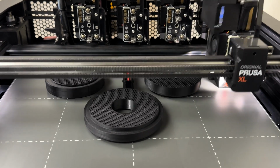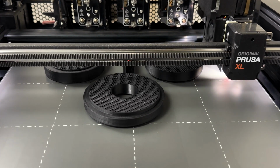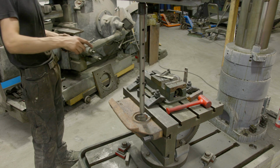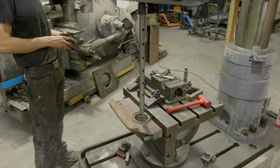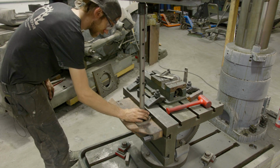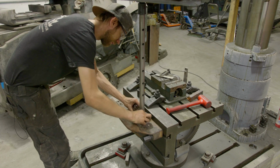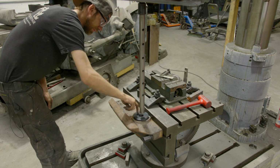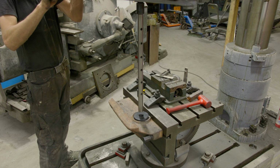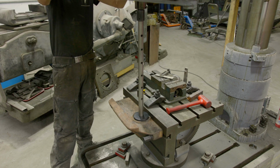I figured out that this bore was 3.5 inches plus a little bit because it's slightly oversized. I measured it, and it's somewhat worn consistently, meaning it's not completely egg-shaped on one side. So I printed out this spacer. This spacer is only here for alignment, so plastic is totally fine. It's a nice, decent fit. And so this is going to help us get the bar centered so we can bring this guy down and make our adjustments.